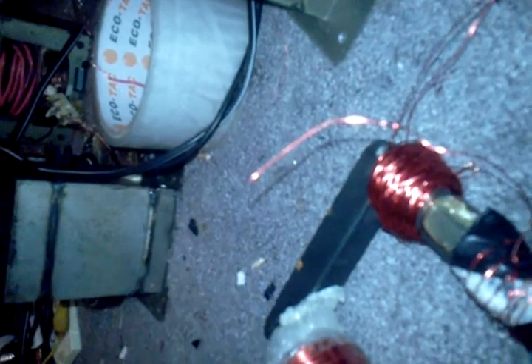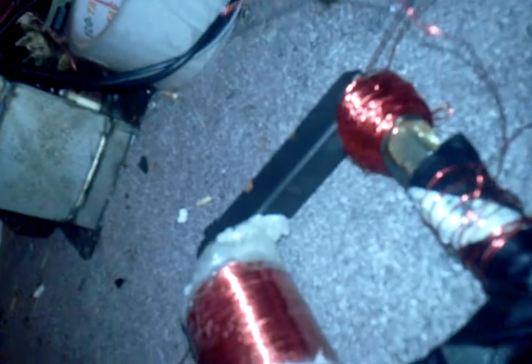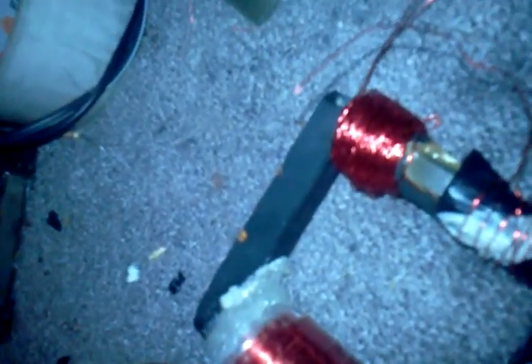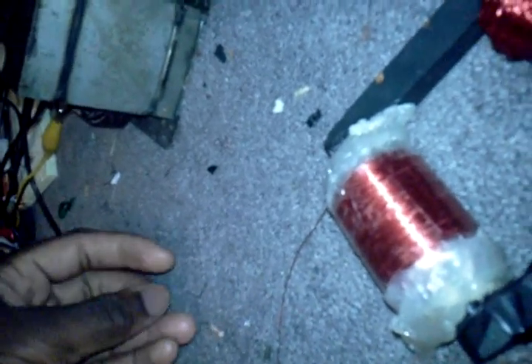That's just about all for this status update. It's actually powering off of 5 volts and getting about a 15 kilovolt arc, and I could draw the arc out to about an inch and a half — about this long, as long as the secondary. I know it's not that much, but to me, for a homemade flyback, it's quite a bit. It's kind of rare to see a homemade flyback actually put out that much, and this is only powering off of 5 volts.